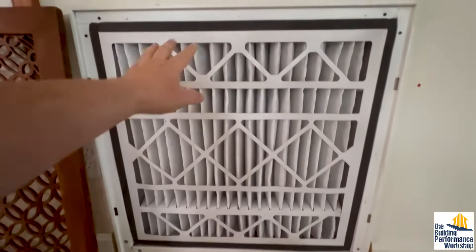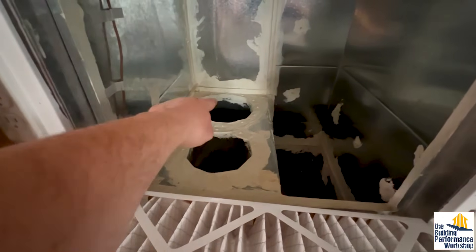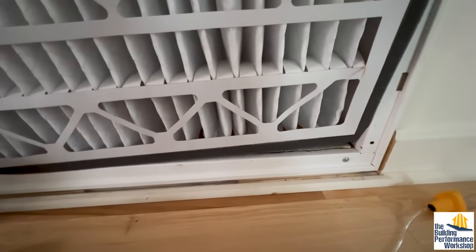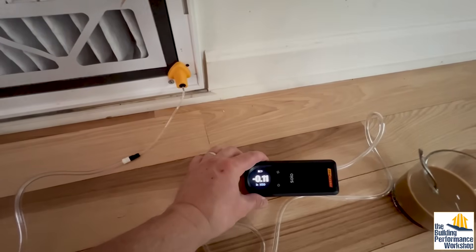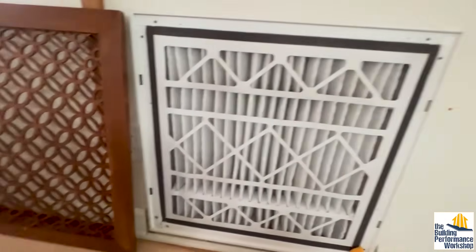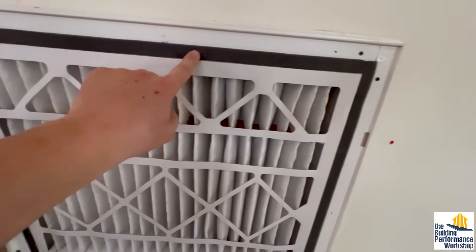Right now you can see we've got a pressure drop on that dirty filter of about 0.29 inches of water column. This new filter doesn't fit perfectly inside my homemade return grill — you can see those fins were manufactured by me. It has returns for the heat pump, dehumidifier, and a HEPA filter loop which has been decommissioned. I have to shove it into the corner a bit to get it seated, but the pressure drop is a lot less — 0.11 inches of water column with these 3-inch pleats versus the dirty 2-inch filter. I want to know if there's air leakage since it isn't fitting right.